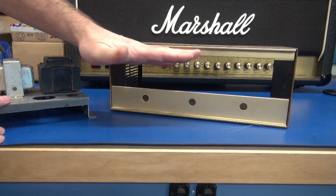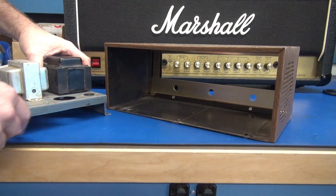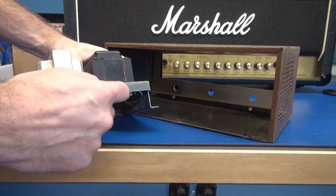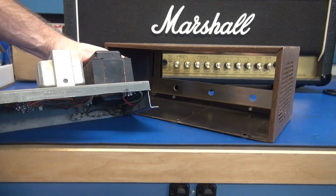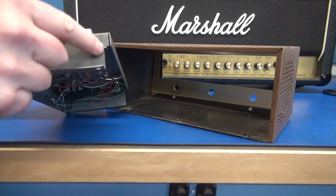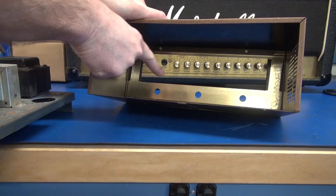To get the chassis to fit into this cabinet, the first step is to mill the front. If you get one of these AO44s, you'll see that there used to be a big oval here and other cutouts for its past life. That won't work in the Regency. You have to actually mill a step out of the chassis to clear that bottom lip.